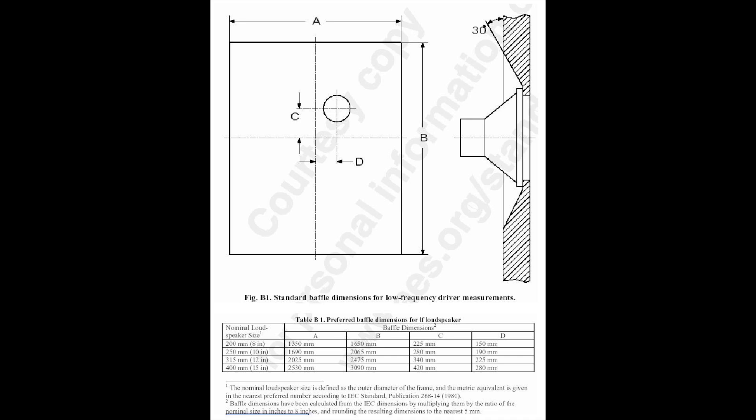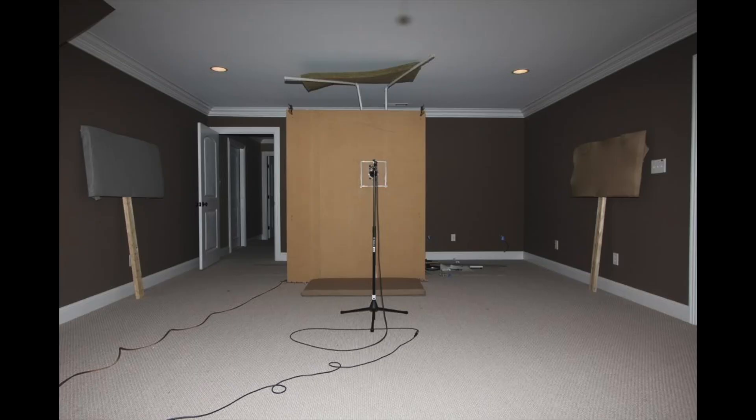One interesting thing I've run into - and something that Klippel even said to be cautious of - is an issue I had with my old baffle. I had built an eight-inch version of their IEC baffle. The IEC baffle has different sizes: I think it's eight, ten, and twelve, and depending on which drive units you're using, that's how big you build the baffle. One was literally as tall as my upstairs room - about eight feet tall. But with the Klippel Near Field Scanner and the baffle module, I can get away with a smaller baffle because it can detect shortcuts due to baffle width and diffraction issues from the edge, and basically mitigate those - so what you get from the raw measurements is essentially an infinite baffle measurement.